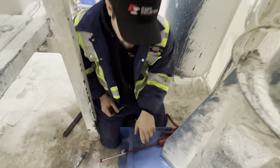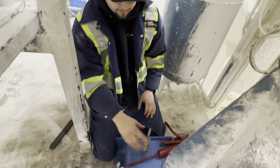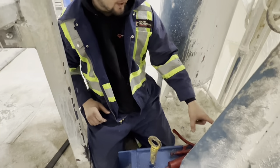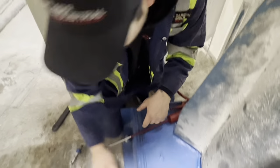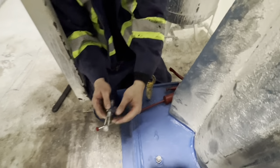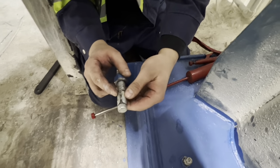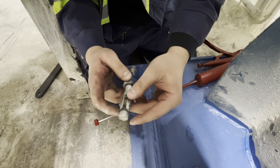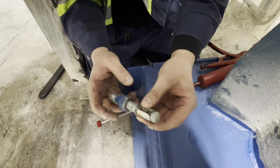We had an issue here with a bunch of leg bolts pulled out or just spinning. There are a couple of things you can do if a leg bolt's just spinning. How a wedge anchor works is this pushes — as it gets bound up in a hole, it slides down and wedges out. That's why it's called a wedge anchor.